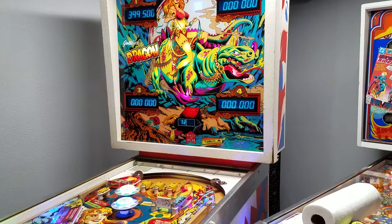I'm going to call that a win today. What did we do? We put in a pendulum. We put in a service switch. We put in a remote battery holder. We reset the audit data on the ROM chip and it's kind of a win — we did a lot of stuff. We got everything fixed except the high score date display isn't quite displaying like it's supposed to. So it's really close — we almost did it. But I'm going to call that a win because we're so close. Thank you all for coming back and checking out Tilt Tech Pinball. We'll have another video coming out here real soon doing those pop bumper driver boards on Mars God of War. Look back for that in the following days. Thanks a lot again for stepping back in. Bye bye.